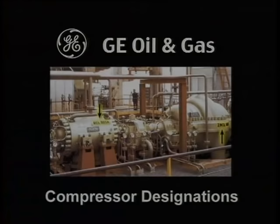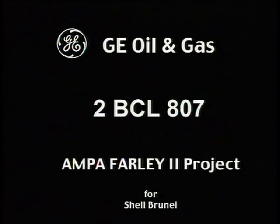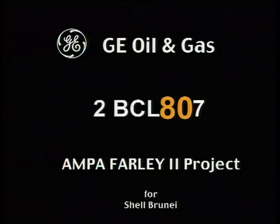Casing sizes and the number of impellers are indicated in the compressor designations by the digits following the compressor model. For example, 2BCL 807 is the designation for a two-stage back-to-back compressor size 800 with 7 impellers.